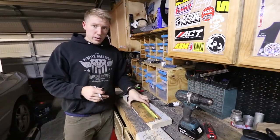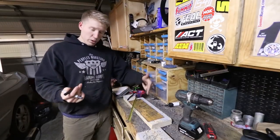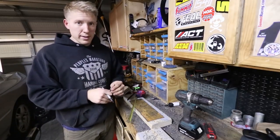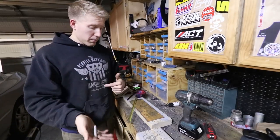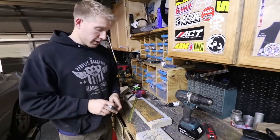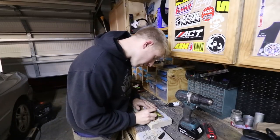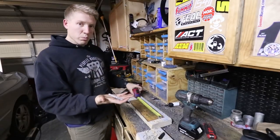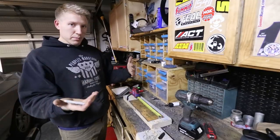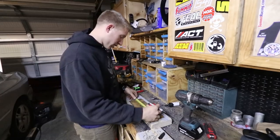I got my chunk of steel cut out and it's all ready to go. This is 12 and a half by four and a quarter is what I made it. Now I got to start putting my marks on here - figure out where I'm going to bend it and notch it before I bend it, as well as put all the dimple die holes in it. First mark I'm going to do is inch and three quarters on both sides, because this is where the actual bends are going to go on both sides so that way it can be boxed in.